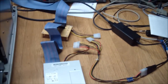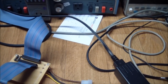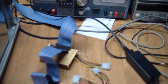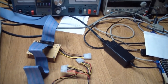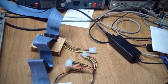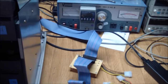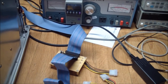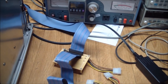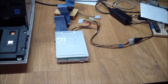The interesting thing was that this will actually work unaltered. Right now, as I said, the line coming from the TRS-80 is coming from a connector underneath the computer. The only difference between that and the internal connector is that the internal connector selects the drives 0 and 1, and the external connector selects the drives 2 and 3. So what you can do is take that connector that's connected externally right now, tear the machine apart, and plug that connector into the internal connector, which is a 34-pin edge connector. And I'm not going to repeat that because it takes quite some time to take everything apart.